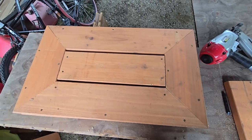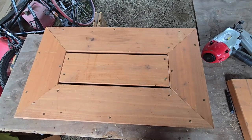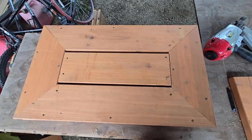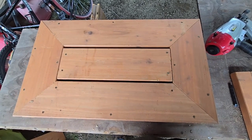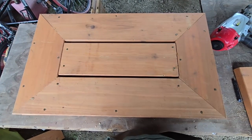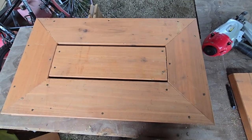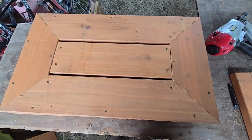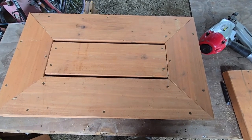So there's the step for the hot tub, guys. It's all just cedar deck wood that's been pre-stained from a deck we did earlier — leftover stuff. I could have used deck screws, but I just nailed it because it's just one step going under the hot tub. It's like a seven-inch step. It's under cover, so no need for pressure treated. If you're going to do it out in the open, you might want to put pressure treated down for the frame below. Basically it's like 30 inches by 17 inches is what it was.